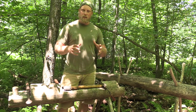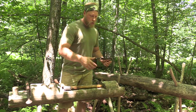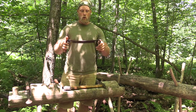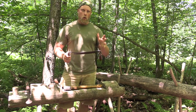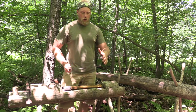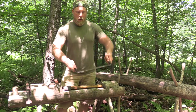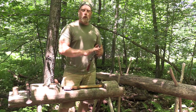If you have trees for legs or stools — anything in the two-inch to eight-inch range — one of the best choices is going to be a draw knife. Draw knives can be found on eBay, at flea markets, sometimes even at yard sales quite cheap. The reason this works better with smaller diameter wood is that larger timber is very hard to twist and turn, and you're usually working longer sections. With two-to-eight-inch pieces, you can put the wood against something, lean into it, twist and turn it, and work the lumber better. You just use a drawing motion, which I'll show you shortly — it's a very quick, simple process.